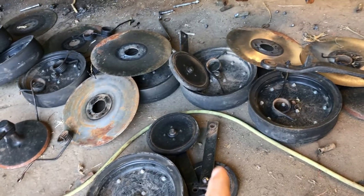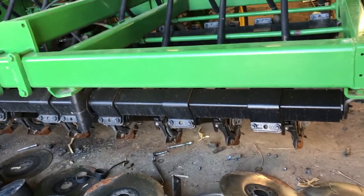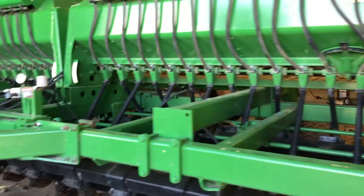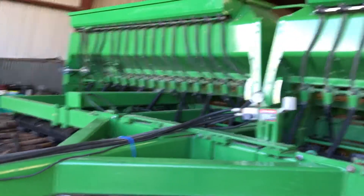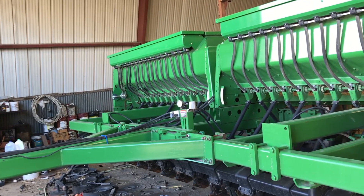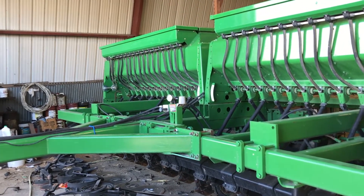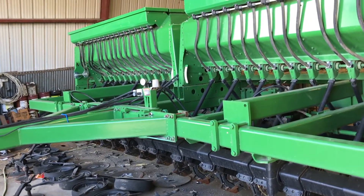Between a 1590 and a 1560, they've also changed the angle of the disc slightly, and they found the wider wheel is just too wide for the seed slot. I'm buying aftermarket wheels — not John Deere ones — but they fit the seed slot better. Those are the differences I know of; I'm sure there are a few more. I appreciate you guys watching — please comment, like, and subscribe for more. I've got several projects going on so videos might come out a bit mixed up, but thanks, bye.